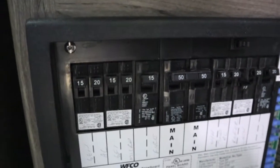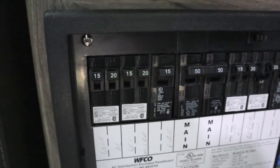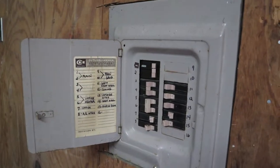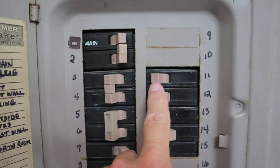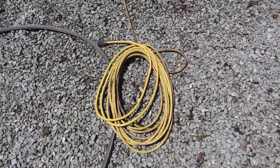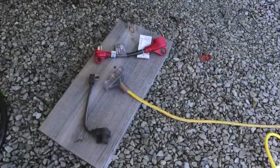So that tells us that on a 20 amp breaker, either AC will run day and night and be perfectly content. Here's my service for the barn where the RV is plugged in. Looking at number 11 on the left west wall — this is a 20 amp breaker also. This is the weak link: a 50-foot, number 12 conductor, 15 amp rated extension cord. So we've just derated ourselves 25% — we went from 20 to 15 amp.